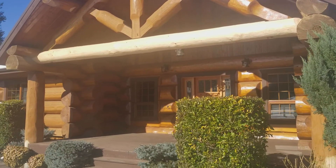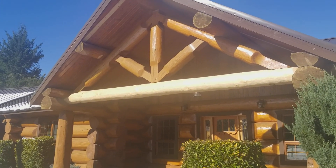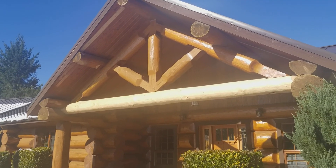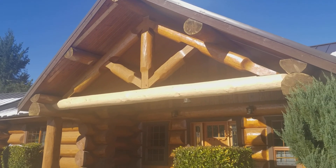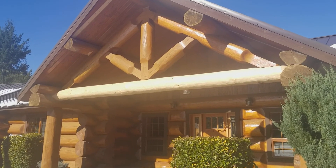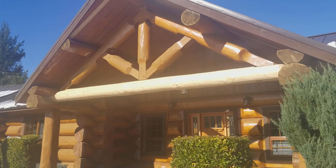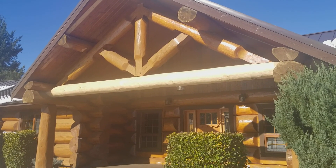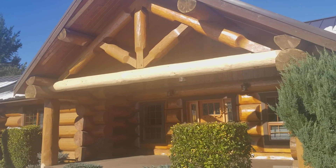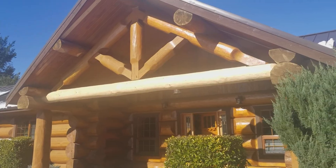Repairs consisted of a variety of very technical repairs. For instance, this bottom log on this truss that was rotten. The previous log had a flat cut on top there, which water just sat up there. And then in excess of moisture over time, and being a structural log, we had to get in there and tear the roof back and pull that truss out of there and craft a new log in there. So it turned out real well.